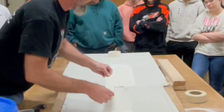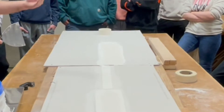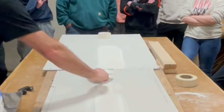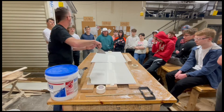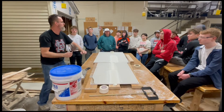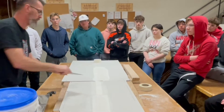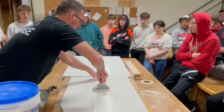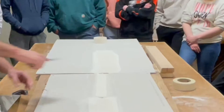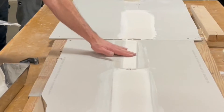Then I take my tape and lay it so it's over top of the joint right in the center. I've got to get all the excess mud out from under it so that the only mud left behind is what is adhering the tape to the surface of the drywall. So instead of going this way, I'm going to go up with it. As I scrape it out — if you start at the top of your wall and run all the way down, by the time you get to the bottom there's going to be a great big bubble as that tape rolls up and out. So you'll start in the middle and go up, start in the middle and go down. I'm pulling everything out from behind it, running over it a second time to make sure. Now that is set nice and tight to the surface.